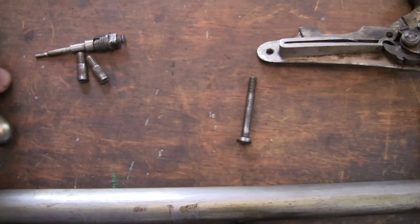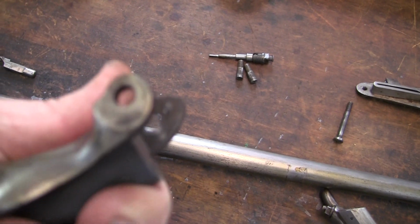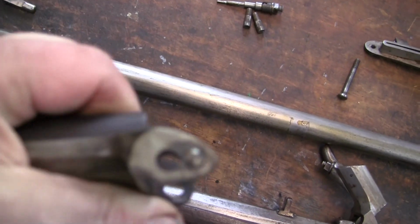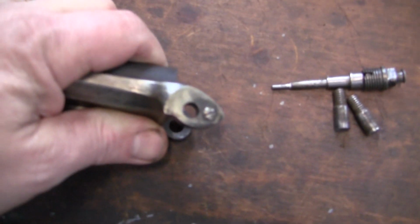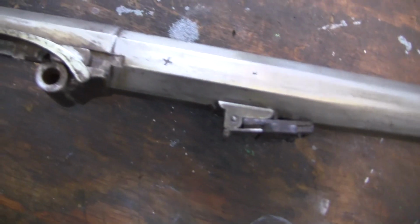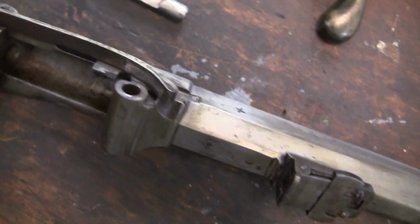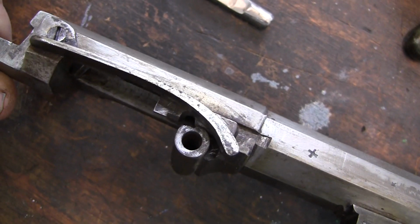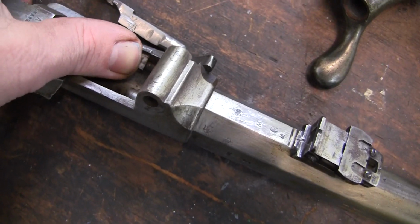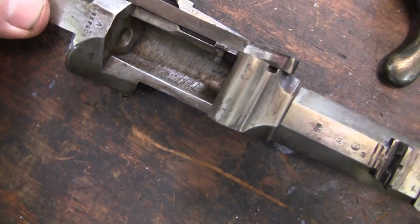And then if you look on the inside of the bolt, or this side, you see where that screw protrudes out there. Hand ain't worth the shit today. See where that screw protrudes out? Well, that screw goes in to this notch there, and that's what moves the ejector, and that's what will pull the case out. And that rides into a milled slot in there.